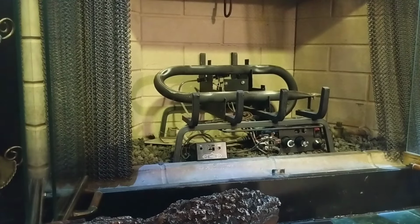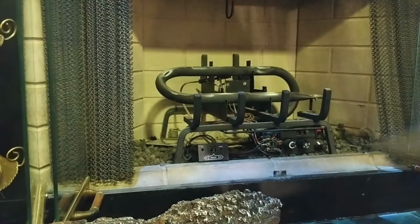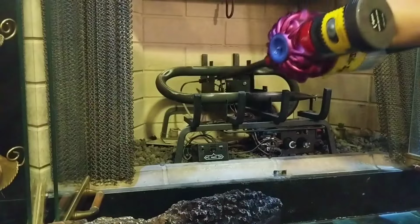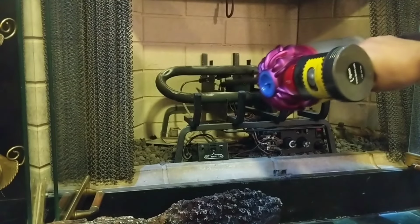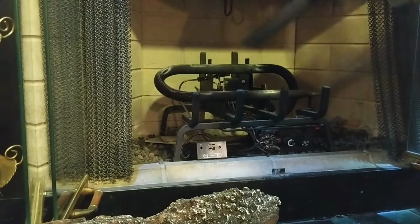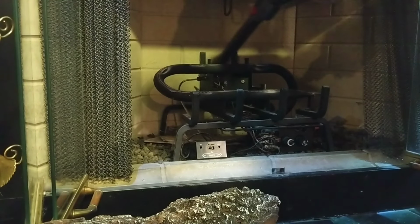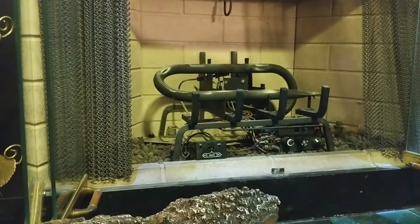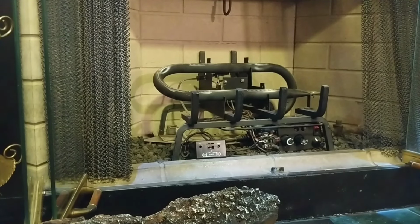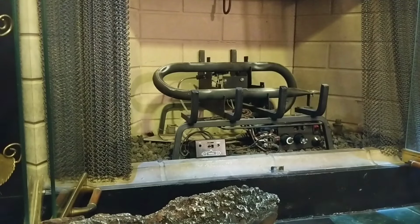Alright, so now that you've got that steel wool and kind of roughed things up, got them back into good shape, what you're going to do is take any vacuum cleaner you have accessible to you. I've got just this Dyson cordless, and you're going to get right up on that thermocoupler on the bottom and the top and try to get all the spider webs and try to get all that steel wool metal that may have connected to the magnet off of there. So go ahead and spend some time and get in each and every corner. And now that that's done, it may take some wiping off. Again, if you've got any steel wool left behind, make sure that that comes off of that striker, but we should get a much more natural pilot light now.